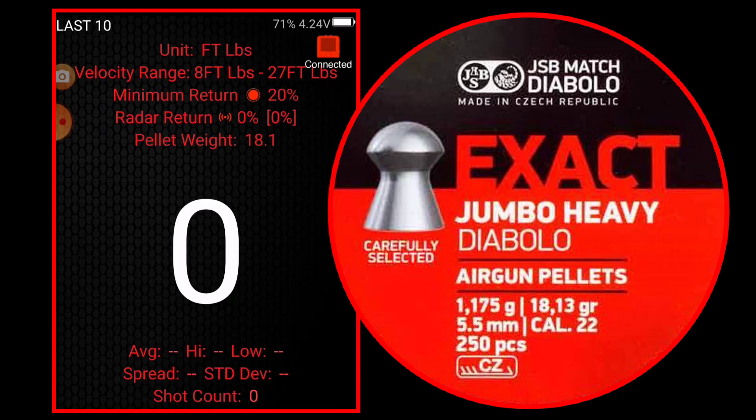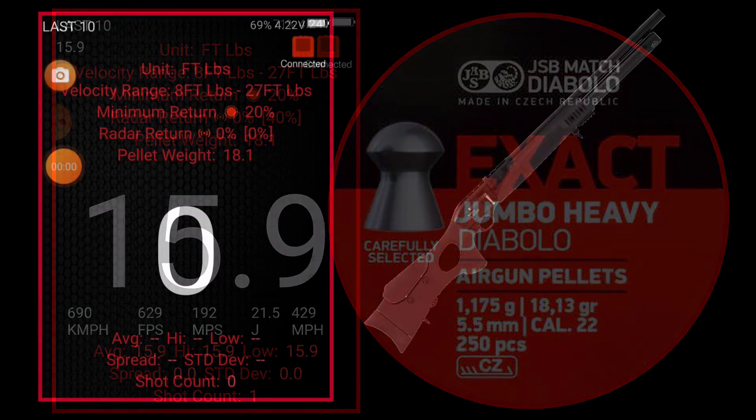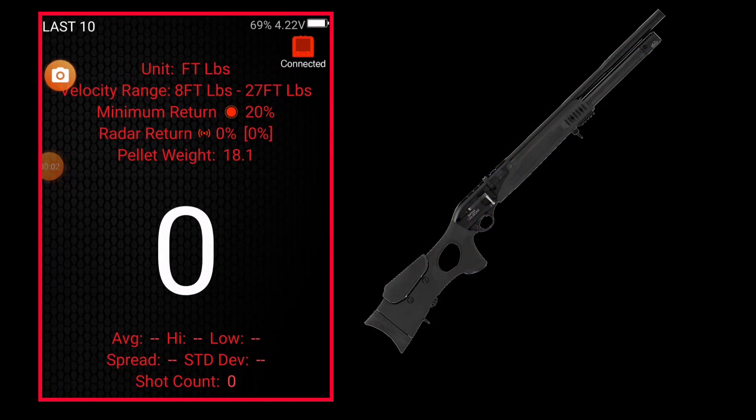The transfer port's been drilled to three millimetres. I've opened the transfer port up to three millimetres, and based on that and the settings it was at before, I was getting 17 foot-pound. So obviously that's made a big difference.